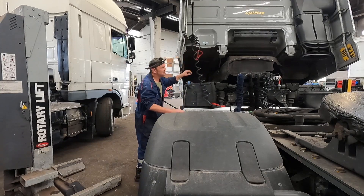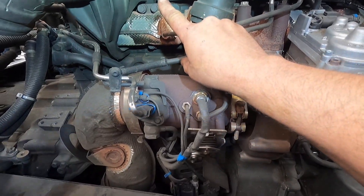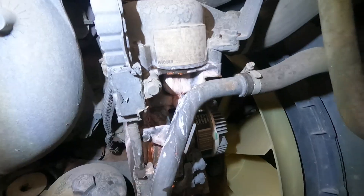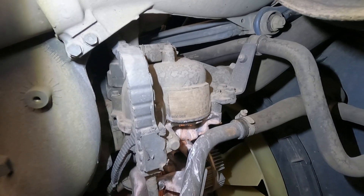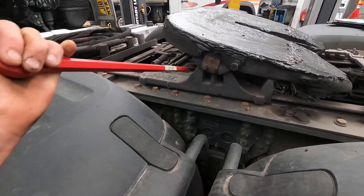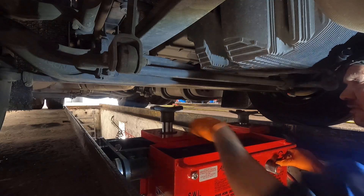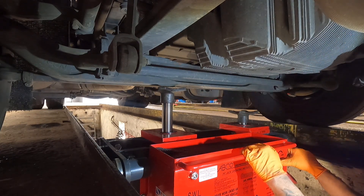There was an extra Susie there — this is an Anderson lead for tail lifts. You're always aware of what you're doing while you're doing it. Once under the cab, it's not just about checking the oil. You've got to look for exhaust leaks — that's the EGR pipe, and then you've got your exhaust manifold there. Then they need to be rectified. We've also got a coolant leak here on the thermostat housing, so that's a little rectification job. It's all about inspection and checking. What I have is a bar to check for bush wear on the fifth wheel.